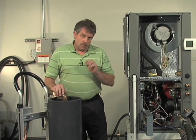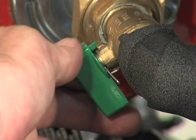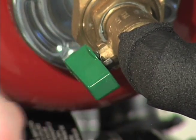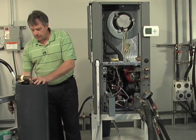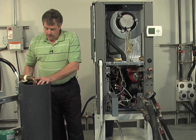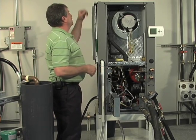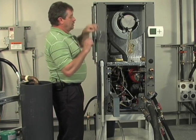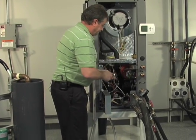But one of the steps you don't want to miss, guys, is we now have an expansion tank in here. You want to make sure you open up that valve. We're going to go ahead and apply our deadheading pressure with the flush cart pump. We're holding at about almost 50 pounds of pressure, so now it's time to rotate our internal flush valves.